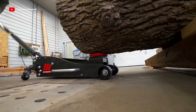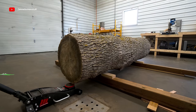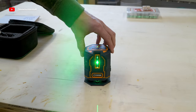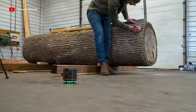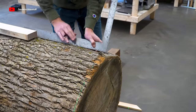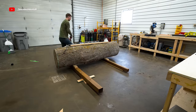After everything dried I took a three-ton car jack and jacked up the end of the log so I could level the beams underneath. Once the log was sitting level I used a laser level to draw my cut lines at each end. It took a little tinkering and eyeballing to get both ends parallel to each other and perpendicular to the log. It's almost 28 inches wide so a little inconsistency isn't a big deal, but now I'm ready to cut off these ends.